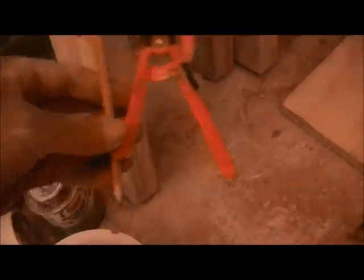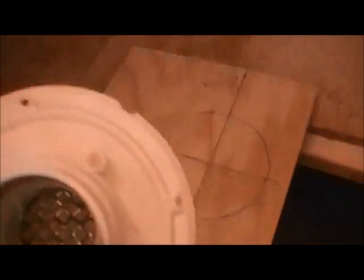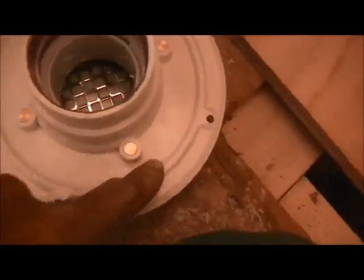I have one of these little things from grade school - a compass - that just sits on center and you mark out 5½ inches. The reason I use 5½ inches is because the edge of the drain, where the taper is going to be, is 5½ inches around. I'll screw the plywood down, drill a couple holes, then get my reciprocating saw, put the blade inside the holes, and cut around - doing the cut on a taper to match up with the taper on the edge of the drain.